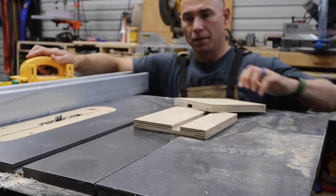If you're interested in picking up this dado stack, there'll be a link in the description below. You know what time it is — power tip time! The power tip is: if you buy a dado stack, make sure you get a clearance plate that actually fits a dado stack, or you can pick up a zero clearance insert and make your own by raising the blade up through it. I didn't think about that when I ordered it, and I ended up using my zero clearance insert to make a dado stack plate. You can usually find those on Etsy or Amazon depending on your saw. The power tip is to pick up a clearance plate that will accommodate a dado stack.